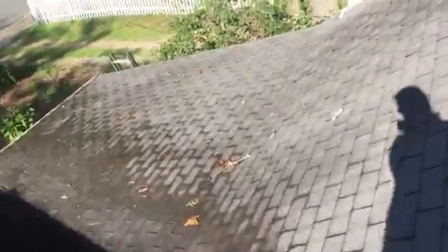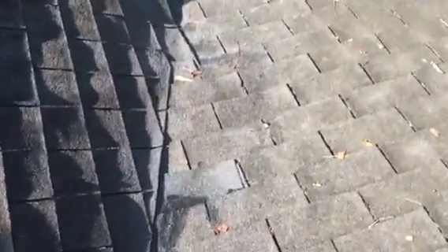I'm sure this roof does see a lot of sun exposure throughout the day. It looks like this area right here in this valley is pretty worn as well. You've got some pretty significant deck rot right here — I can see it just from the curvature of it. It's awfully spongy. You can even see that there have been a couple of repairs done in this area in the past.